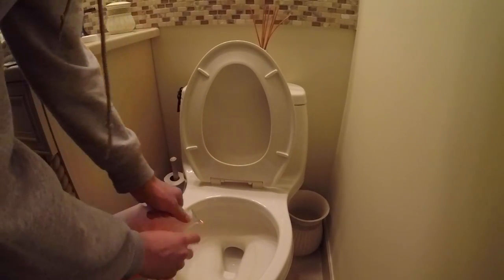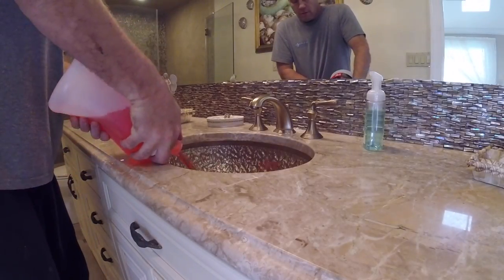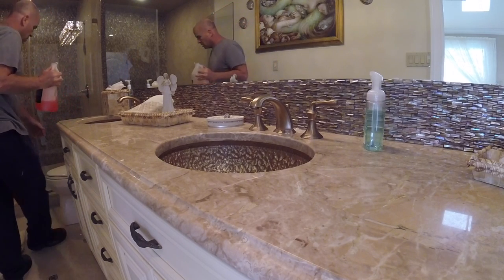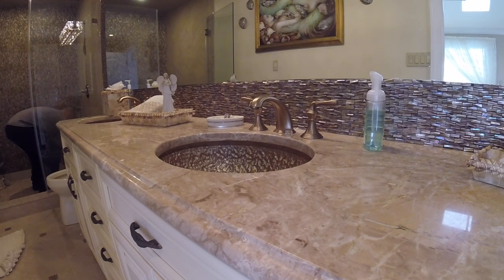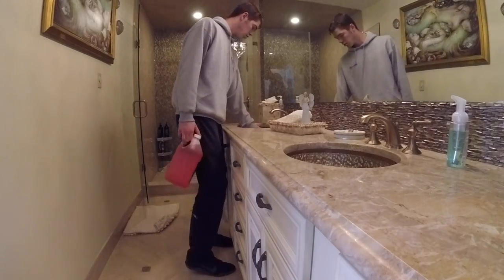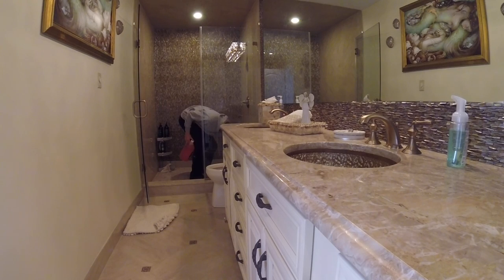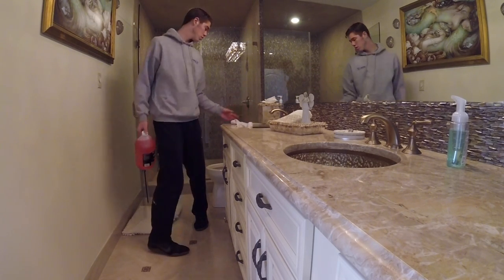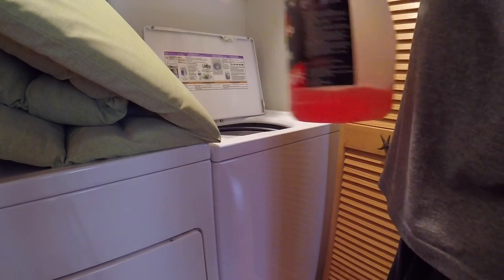A little bit in the toilet. A little bit in the toilet — the tank's empty, right? Yeah. I'll give you the other gallon — a little bit in each tank. Toilet and shower drain. Close that toilet lid and the door. Always a little bit of antifreeze in the washer machine — open that one up an inch. The other bottle of antifreeze — and of course pour some down the drain here.